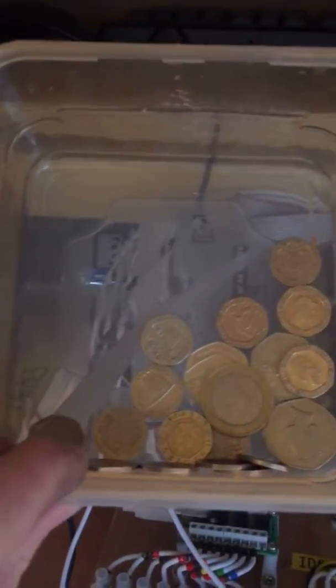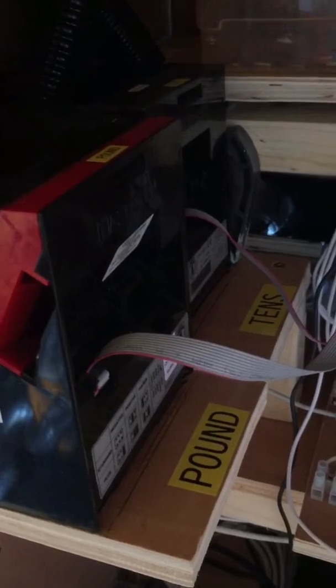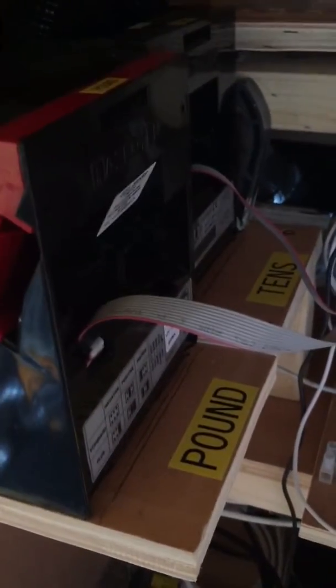The stuff that goes in there is 20s, 50s, £2 coins, so valid coins, but ones that aren't a 10 or a pound, because those are directed into the hoppers. The only thing with the Cash Flow is I've noticed it takes old pounds and new pounds and shoves them out the same hole. So you have to ban old pounds going in, because otherwise after October you're going to get paid in old pounds and they're no longer valid.